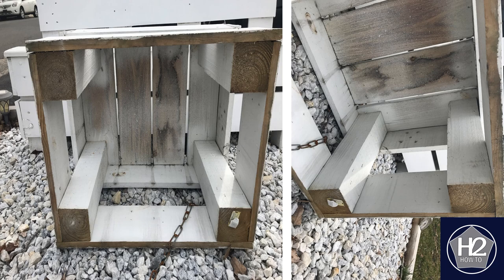Here we see the bottom. What we're looking at are the posts, and this particular board was screwed in from the top. We then see the lag screw which is attached here as well as in this direction. The bottom piece is flush with the bottom of the 4x4 post — that's just the way I aligned it. This was painted with exterior paint, and about every two years I go through the process of painting it again once the pressure treated wood dries. When drilling the screws, make sure you are pre-drilling — use the drill bit to put the hole through the piece going through the 4x4, then put the screw in to prevent any splits and breaks in the wood.